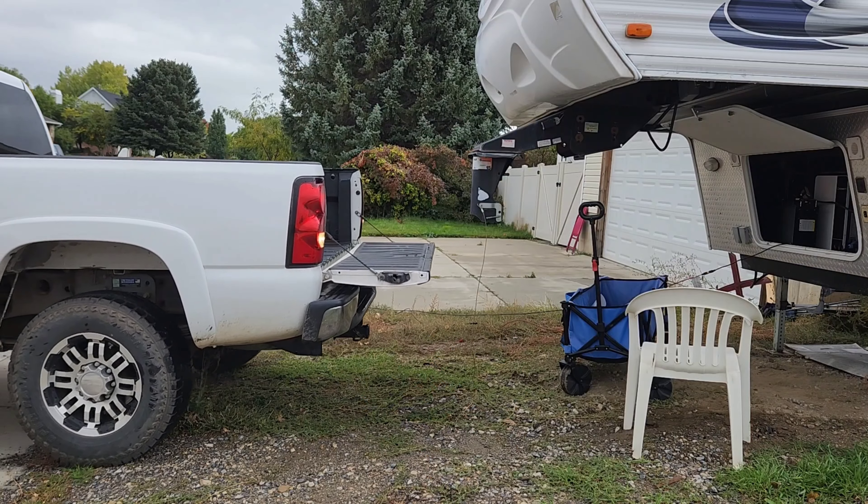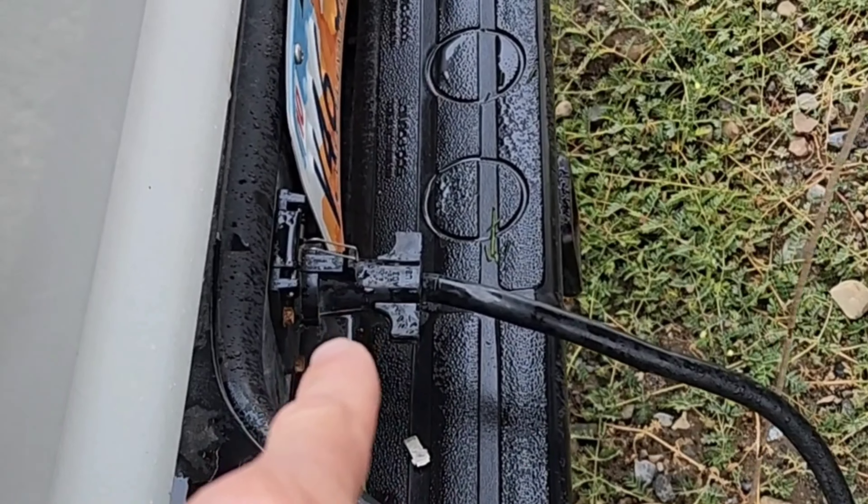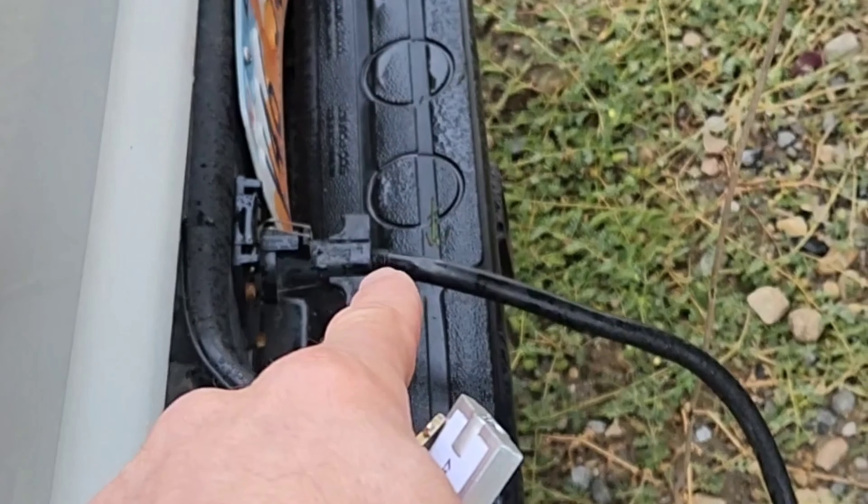It's super dark out here — it's like 4 o'clock now, so I'm not getting too much solar power. You can also charge this from your engine battery, so I'm going to pull my truck over here. Now usually when you have a deep cycle lead acid battery, you don't want to connect it straight to lithium unless you do a bunch of extra stuff. But this battery power station already has all that stuff built in, so it can be charged from a lead acid battery or from the alternator. I just remembered I disconnected the 12 volt auxiliary power from this plug because I did have a lithium battery running my RV and I didn't want to have to install a DC to DC converter in order to get that to work.